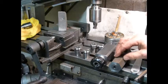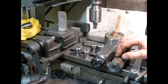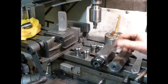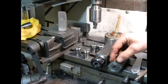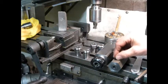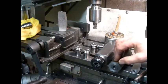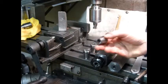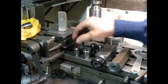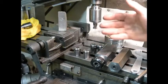The function of the hex version is to be able to put hex ends on a fabricated bolt. Quite often one needs to make a special bolt of some length or diameter that you can't buy off the shelf. It will be nice to be able to put a hex end on it rather than turn it into a slotted screw. This will also allow me to thread it, because the collets will hold the threaded portion very nicely and firmly without damaging the thread, and then mill the hex end of whatever size I choose.